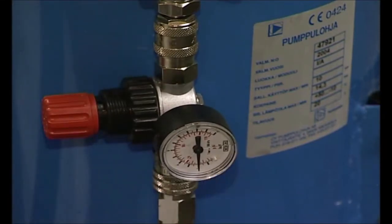However, a critical thing to realize is that you need a good compressor, with the capability to produce a minimum of 300 litres per minute of compressed air at 6 bar, with a constant flow for the removing of the granules from within the duct. This is done by simultaneously brushing and air jetting, because only brushing with the help of suction from the vacuum unit is not enough to move or convey the now heavy, greasy granules. So you may use 2 separate compressors, or one very good one from which you have 2 separate air lines.